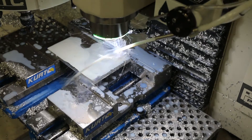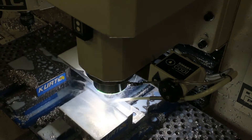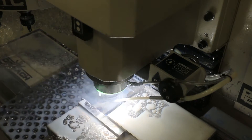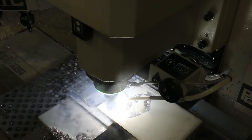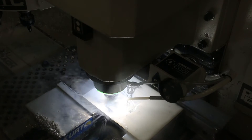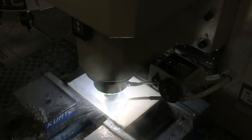When it starts spinning, it throws coolant everywhere and it is working effectively. When it's on the side of the plate where there's no surface for it to land on, it just works through. When there's a plate underneath during a facing operation, it works pretty well. One tweak would be to lower that height so it lined up with the arc of the cutter to see if that gets the coolant more in the right place — or alternatively, have it come in through the center of the tool and flood out from that center point.